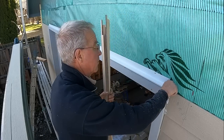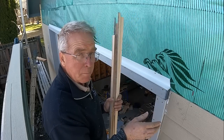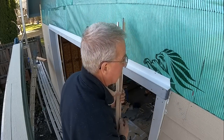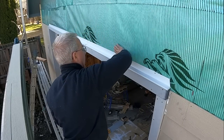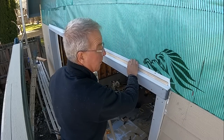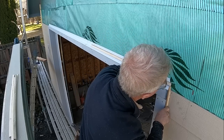The next part of this process is to put a little sleeper — a strip that goes back behind the siding. No one will ever see it except the bugs that try to get in there and cannot. It's just to maintain the same angle of bevel that we've got everywhere else. Because if we didn't, by the time we got up here and nailed it back, it would be flat. Not good. These things are five-sixteenths by three-quarter and they're going to hold this projection about right.